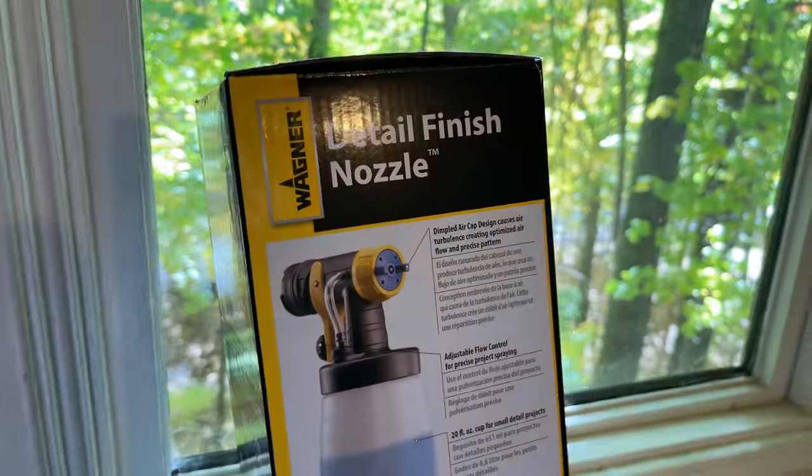I'm just going to do a quick visual inspection and then bring my light in to make sure that I'm not missing any spots. You can see there's a line here, like some sort of hair caught in here. So all these things should be sanded out before we apply our second coat. And then I bought this today.